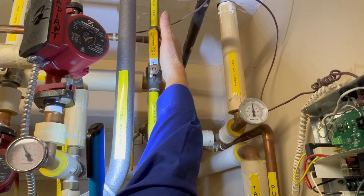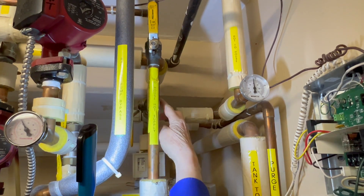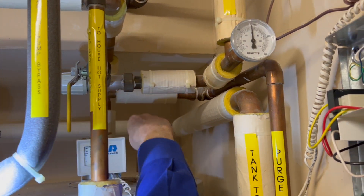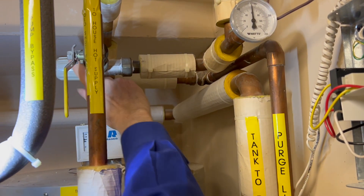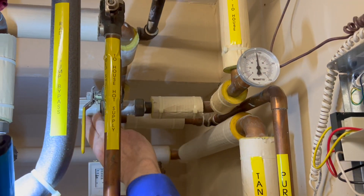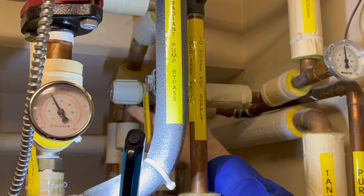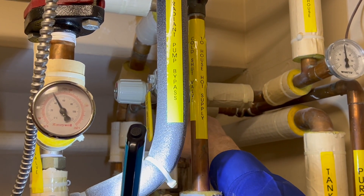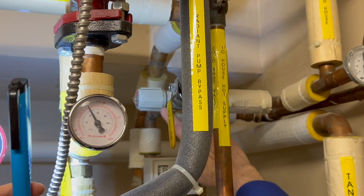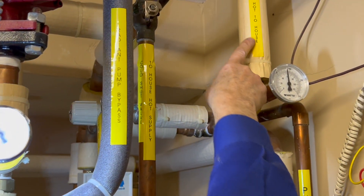The pipe's getting cold — somebody is using hot water in the house. You've got cold water coming in here to the mixing valve, and hot water right behind the mixing valve coming out of the water tank. This knob can adjust the hot water going up to the house, but this mixing valve is jammed from scale in the water, and I'm going to call a plumber to rebuild this valve. I saw it on the internet — it's just a pain in the neck to rebuild, but I'm sure plumbers could do it with their eyes closed.